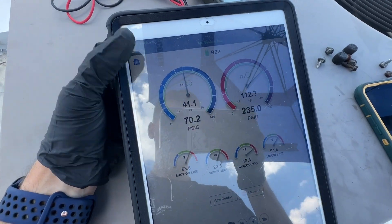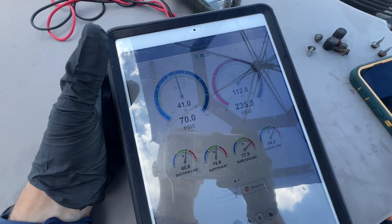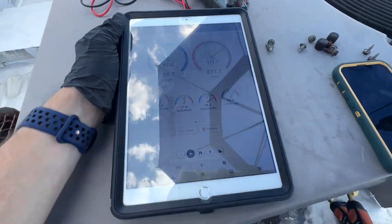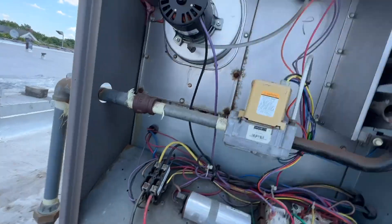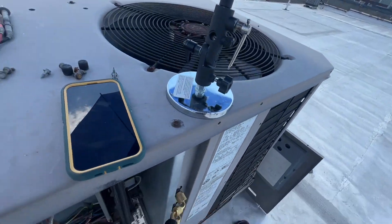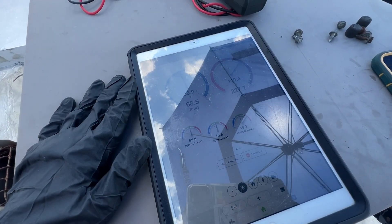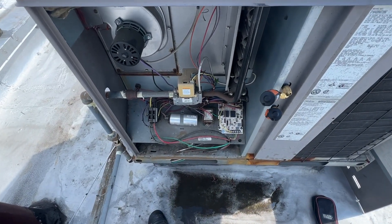Our capacitor tested good and none of the motors are seized, so hopefully our pressures are okay. We got our new control board in. Here are our pressures — our low-side temperature is a little bit bouncy but hovering around 43. Our fan is going and it amps out okay. Here's our new control board — cooling's running. We are good to go, so I'm going to fill out the invoice, include all the information and my pressures, and on to the next.